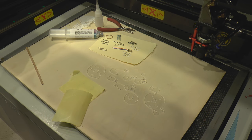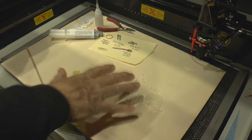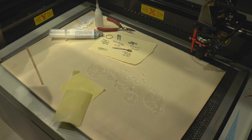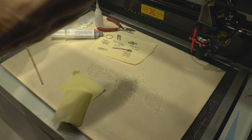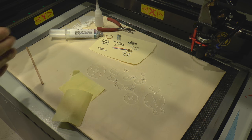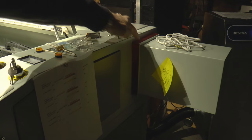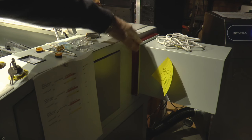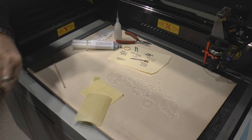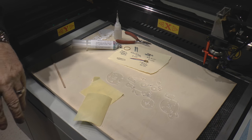I have to apologise yet again for inflicting another laser pointer onto you. I made a laser pointer to suit this particular light blade machine because I had serious limitations on the space between the laser tube and the first mirror. When I reset the machine, I actually increased the gap between the mirror and the laser tube by putting this extension on the back here. So I've increased the gap by 30mm, which means I've got all sorts of room to play with now to take the best elements of that design and make it even simpler.